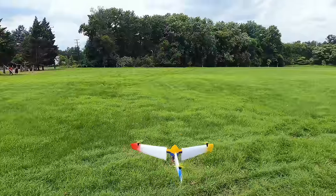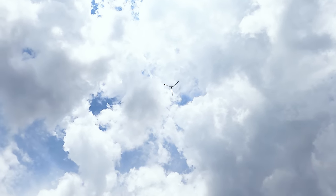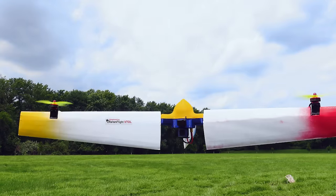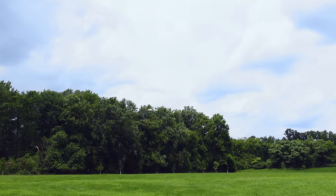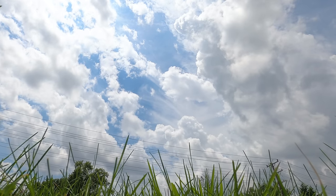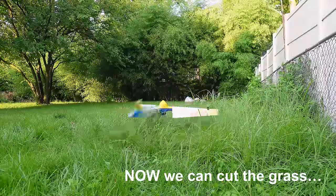What's cool is that we now have small drone propellers operating much more efficiently in hover on this vehicle, with high inflow as we discussed earlier. We don't need two different propeller designs for hover and forward flight like many other VTOLs do — we can use the same propeller design for both flight modes and get the same propulsive efficiency. In the next video, we'll take a look at power consumption in forward flight, and maybe even touch on new control methods for intuitive directional control while it's spinning. I've got some tricks up my sleeve for that, so make sure to subscribe so you don't miss it. Cheers.